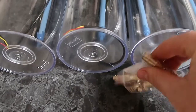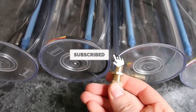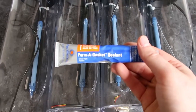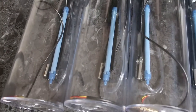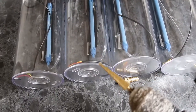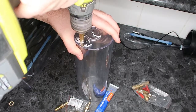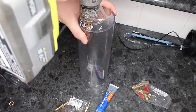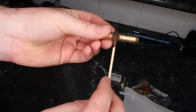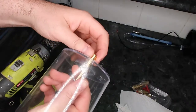The reason that we want to do that is so any of the liquid or the algae can be drained off if I need to, and also any of the biomass we can get to come out through that bottom. I'm going to use this gasket sealant which I'll put around the base of it to actually seal it, and I'll also use some silicone later on the bottom just to double it up. I've got this drill bit which I'm going to drill out the holes to the exact size. Then all we need to do is add a generous amount of that sealant, place it in the right spot, and we've got the nut that'll screw onto that thread. I'll use a shifter just to get it tightened down a little bit.